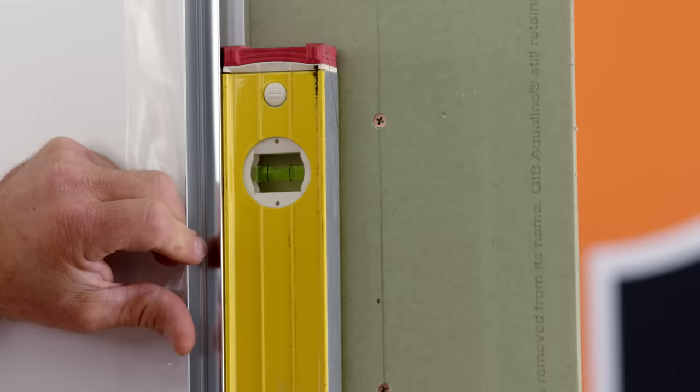I've got my wall profiles on — now it's time to start assembling our door frames. We've got a bottom extrusion and a top extrusion, and what we've got here is a side panel. When we're installing these, there's a little locking mechanism on the side that's going to connect to the wall profile, so at this stage we're going to leave that open. To do this easily on my own, I'm just going to assemble this on a table. Be careful with the edges of the glass — don't place it on any hard surfaces without protection as it could shatter. The first thing we do is slide our channel onto our glass and attach it with a couple of screws at the back. It's exactly the same for all four corners. Grab a spare pair of hands to help you lift the frame into place.